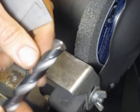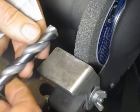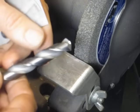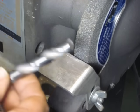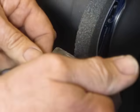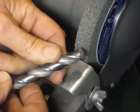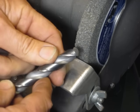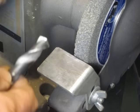This is a drill that I purposely mangled because all my drills are sharp — I couldn't find a dull one to use, so I kind of ruined it on the grinder. Now I'll show you a step-by-step procedure on how to take it back to its original condition. There are basically two different point angles on drills: a 135-degree included angle, intended for harder steels like tool steel and high-carbon steel, and a 118-degree included angle, which is more of a general-purpose drill you can use on mild steel or non-ferrous metals. I like to grind all mine to 118 degrees — it seems to be a good all-around angle.